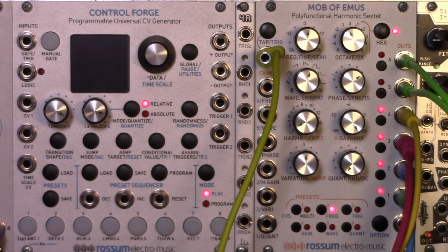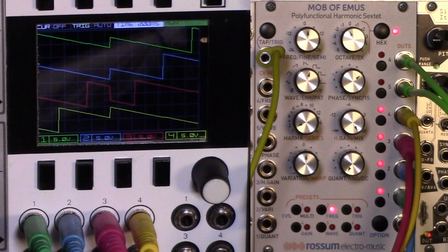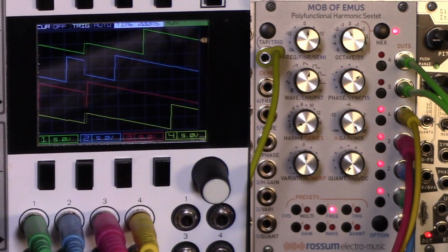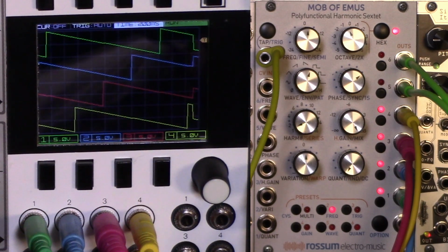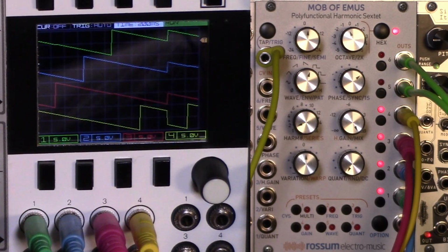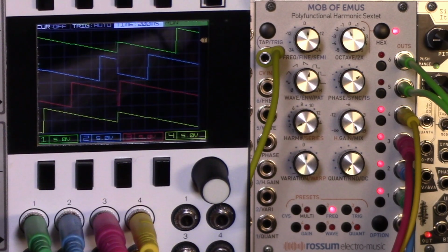For this example, I will use the Quadrature LFO setup, which is conveniently preset 8, with channels 1 through 4 already configured. So I've selected those channels and adjusted the frequency range. Then I patched each one to the Befaco Percall for a simple envelope VCA combo, where I have oscillator signals coming from channels 5 and 6 split among the inputs there.